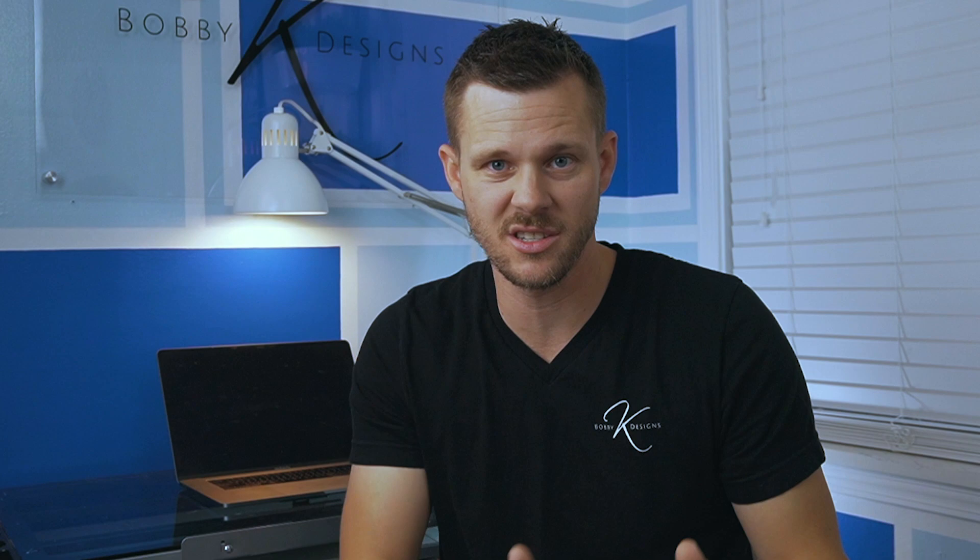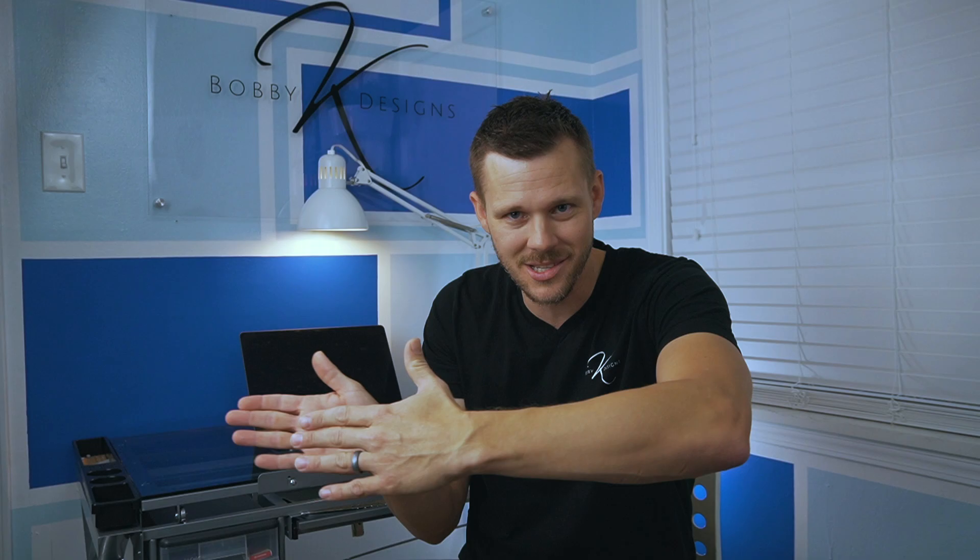Design number two is a little bit more simplistic. What we did is just continue the gravel along the driveway. I would still recommend putting a compacted minus base so that if somebody slips off the driveway it's not just going to completely settle down — but this is going to be cheaper than doing pavers. You can just continue the gravel all the way up. As far as the hillside, we stuck with the boulders and put some light landscaping in there as well.